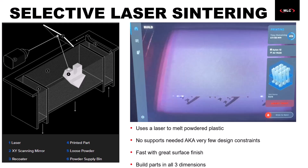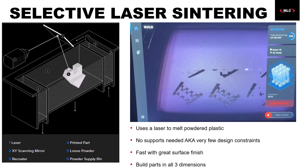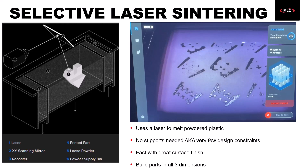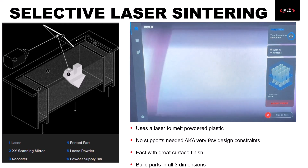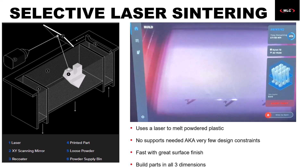There's an extra benefit: your Z height all of a sudden becomes much more useful because you can stack parts in all three dimensions and produce huge quantities at one time. It's also a super fast way to print things — you're printing entire layers in just a couple of seconds. Here you can see a layer finishing in just a couple of seconds, then a fresh layer of powder rolls across and we start melting the next layer, which fuses to the previous layer and so on.